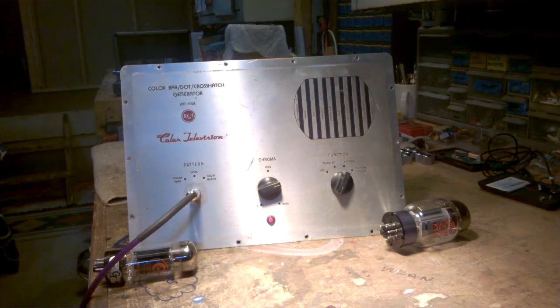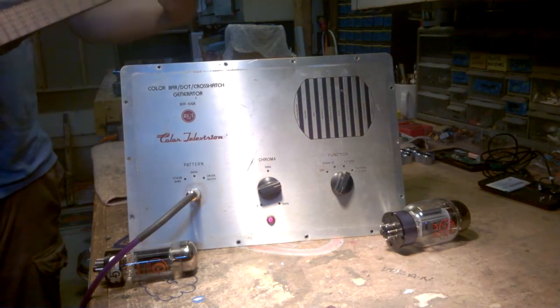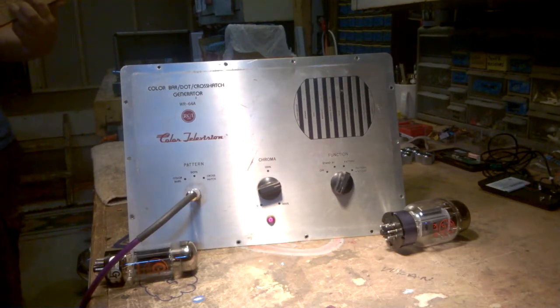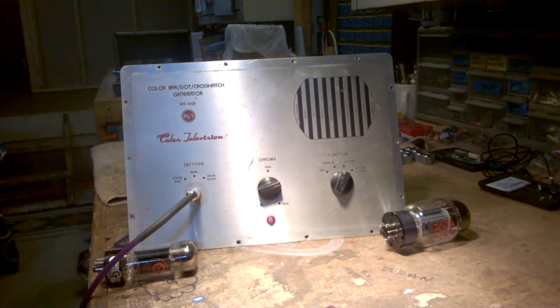What I've done with this amp — which is also a Fender 5F1 Champ clone circuit, probably one of my favorites — you have your input jack on the left, your volume pot in the middle, and the NFB pot on the right-hand side. A lot of people are going to say 'oh it's got a tone knob' — that's not a tone knob. Tone knobs are on your guitar.